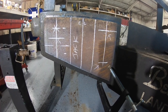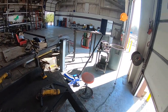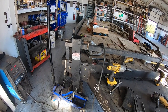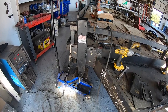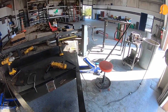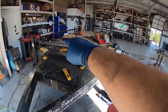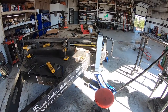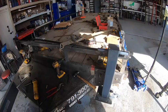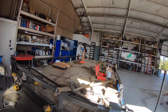I'm going to drill these out, put it back up, mark them on the trailer, and do the same thing on the other side. Afternoon now — we've got the jacks up in place, just resting on my floor jack. Plates are mounted and we're going to be welding the jacks to the plates next. Then I'm going to unbolt this one, slide the pipe over both, and re-bolt. Got them squared up, all ground and ready to go. Those are all welded up and bolted on — technically you could jack this thing down if you wanted.